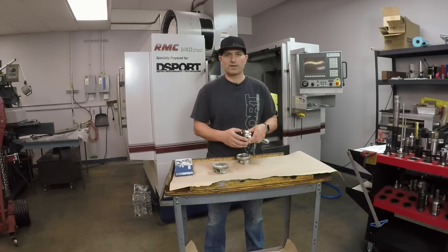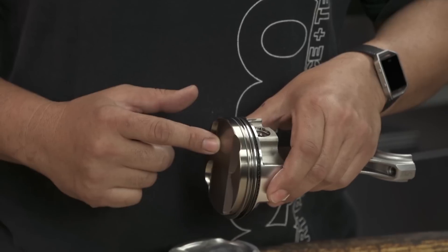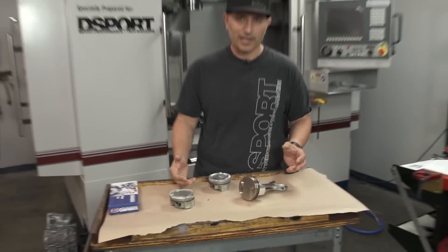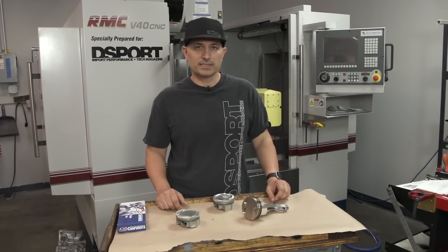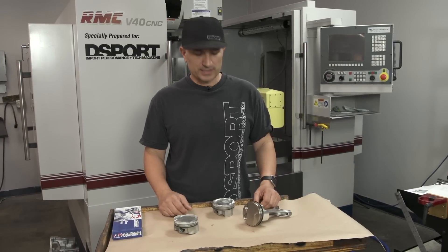These coatings might be 25 to 100 microns thick and are extremely hard and extremely corrosion resistant. Nickel is an element you'll find in different alloys like Inconels and some of the higher-temperature stainless steels, and it just has really good properties at high temperature.